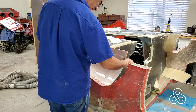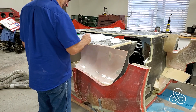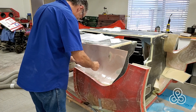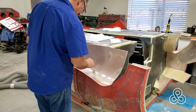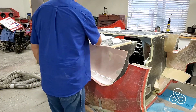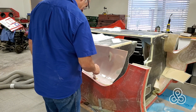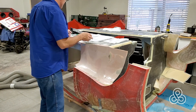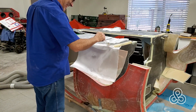The first thing is to spread some resin on there and put some real light three-and-a-half ounce cloth on the bottom edge — that is where that little turn-back flange is that we created with our metal flashing in the mold. We want to keep that nice and thin because that is an edge facing the street and we don't want it to get thicker there. That real thin cloth is what we'll use to bond to that finished fiberglass edge. We'll also put a little heavier cloth to cover the whole thing to seal in the body filler and keep it tied to the floor.